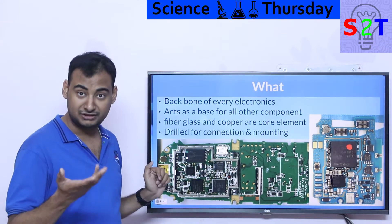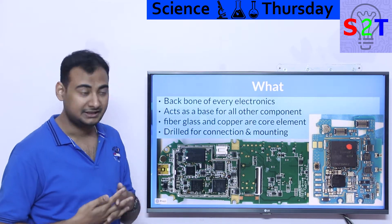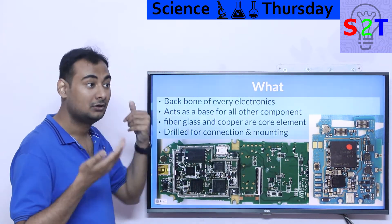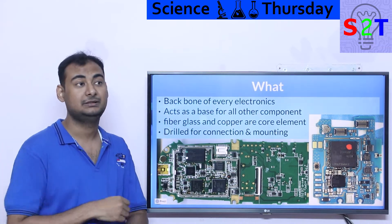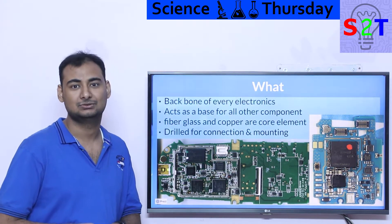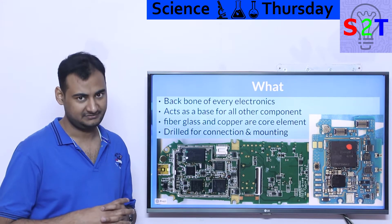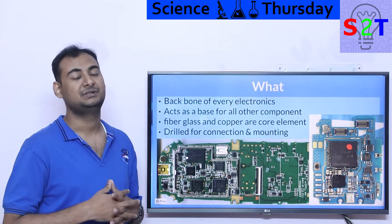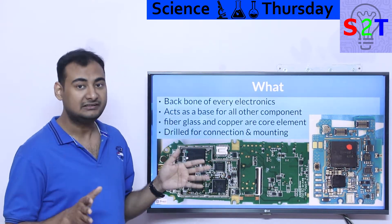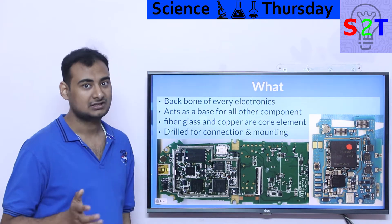Many times holes are drilled for mounting purposes — because it's a physical structure you may need to mount it to a case or a grounding plane. You may also have drilled holes for through-hole connections, basically connecting the back side to the front side or connecting layers in between, because PCBs can be incredibly complex. We start with single-sided PCBs, then two-sided, then motherboards easily go to four layers. Avionics aircraft use 18-layer PCBs, and some go upwards of 50 layers. Even a basic mobile phone system easily reaches five to six layers. So holes are very important for PCB.